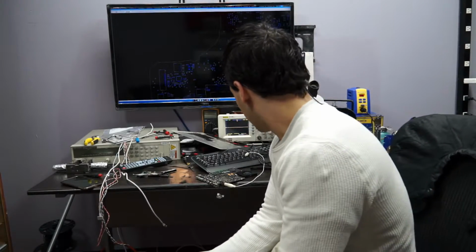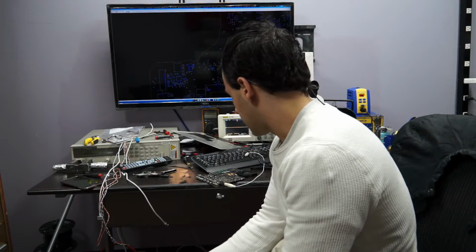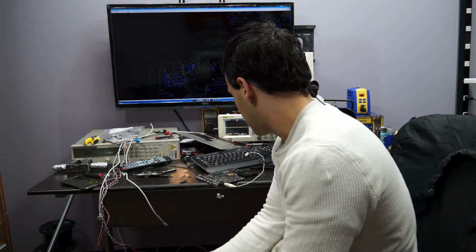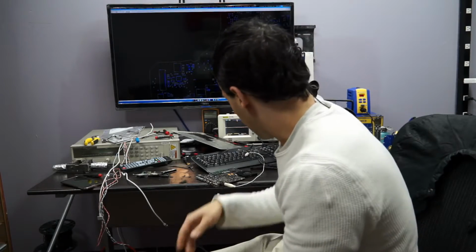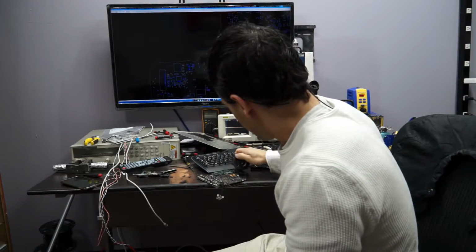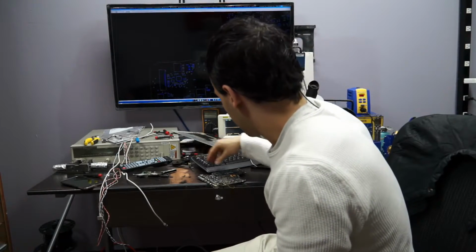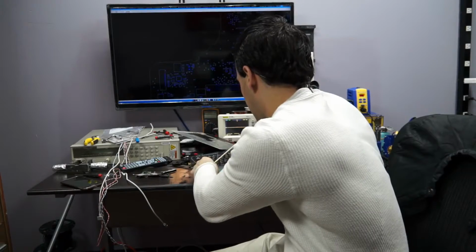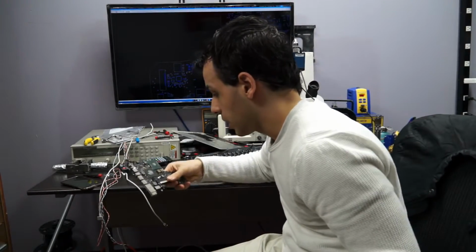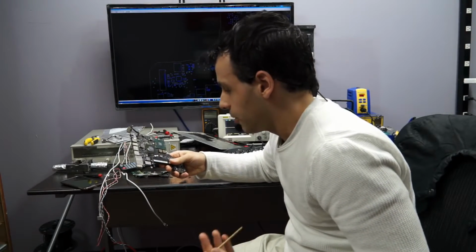Well, unfortunately, this board doesn't turn on because it's messed up. The video actually froze for a moment, where I was measuring for RTC. This board does have a bad MCP, since it has been pissed on by a cat, and since this is 5 years old, and I don't want to buy chips that don't exist new for something that is 5 years old so that I can resell it for a low amount of money, assuming that I'm able to fix all the other cat piss problems, this board goes in the bin. But hopefully you learned something.